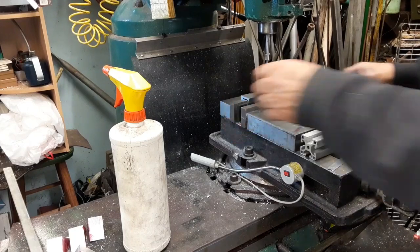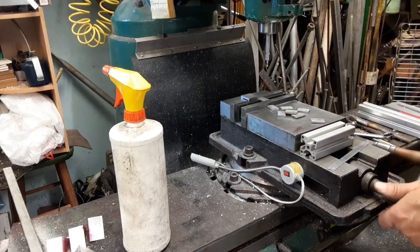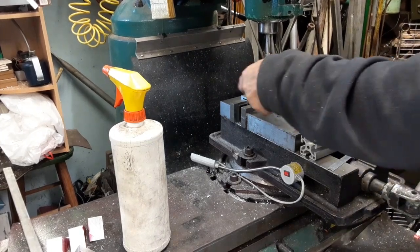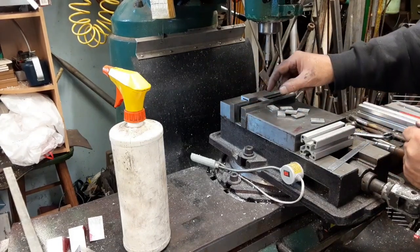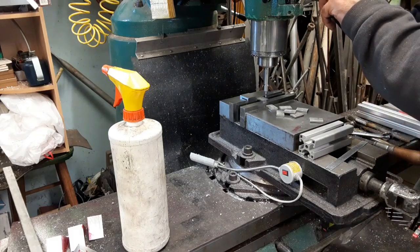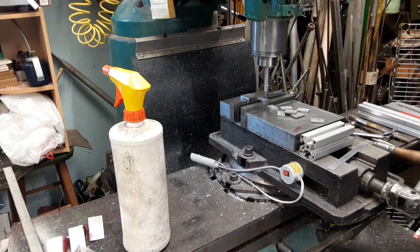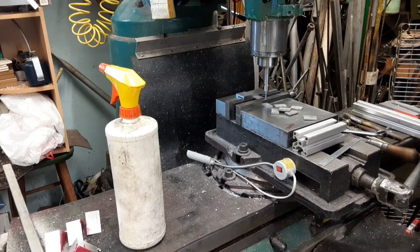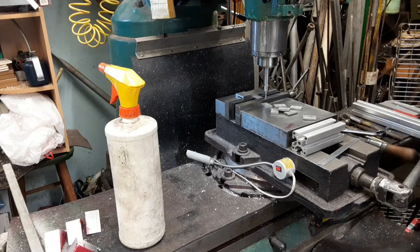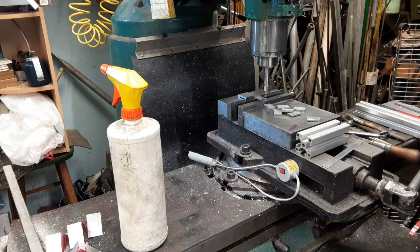Like that — see, there's plenty of room. That's what I'm going to do. So now I'll pick up the edge and the edge, and then I'm going to drill them this way for the center. Because we want that hole kind of on center. We'll pick up this side for the back jaw — right there, zero. Front jaw.